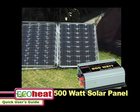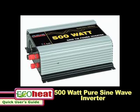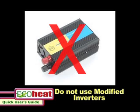At 500 watts, you can use a solar inverter. Now, be very careful. You will need a pure sine wave inverter to work the cooker. Modified inverters will not drive the cooker. It must be pure sine wave, no exceptions. We can recommend Ravco Inverter Specialist. Ravco is a very reliable company, very cost competitive and experienced in the use of Ecoheat and inverters. So contact them for more technical information.